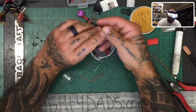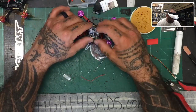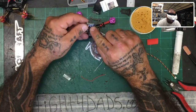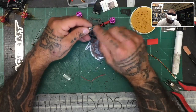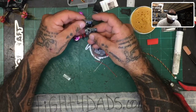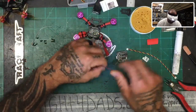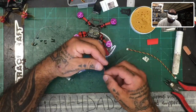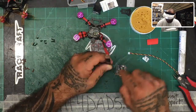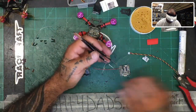Looking at how this board is going to sit, I can loosely fit the pieces to see how I want it to go. The antenna comes out backwards, like that. Smart audio is the third pad from the bottom here, which corresponds to TX6. I'm going to drop the wire straight out the back because it'll flip right up to the board above. I'll use tweezers, line it up, and go straight out with it. That's it — done. Less than a second of soldering time, guys.